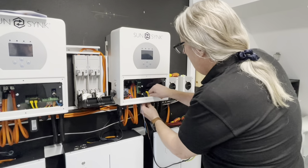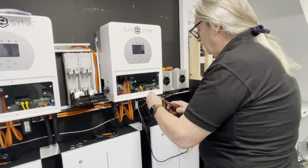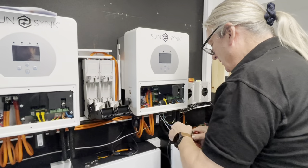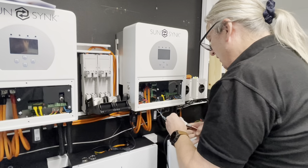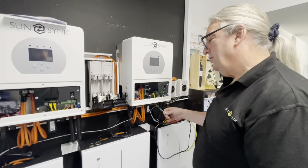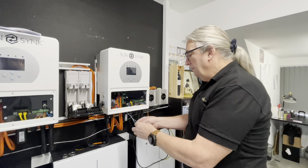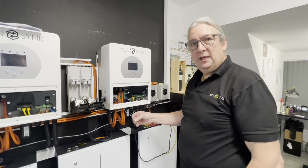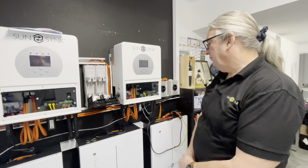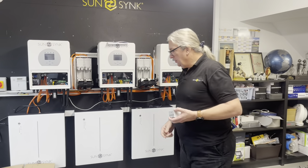You need to make sure you switch it on — I can demonstrate that in a second. Make sure you've got the signal. Now we've prepped and as soon as the relay arrives we can demonstrate an earth-neutral bond relay. These would be much heavier cables — on a 3.6 these need to be about 2.5mm at least. These are fine as signal cables, but you should put some sort of protection or inline fuse on the live wire to be fully compliant. The relay should be in a separate box at the side rather than just floating.